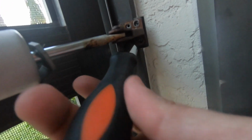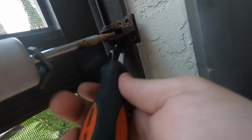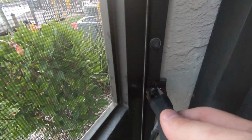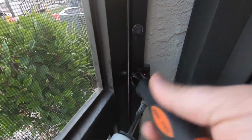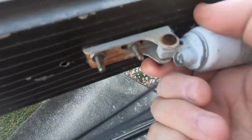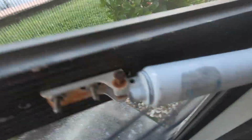This is a little overkill with 3 on the top and 3 on the bottom. The new pack, I believe it only has 2 on the top and 2 on the bottom. Finish it by twisting by hand. And this whole piece should be pretty dangly at this point. You can go ahead and pop this pin out. It comes straight up and straight down. Sometimes you might need some kind of hard object to hit up on it. And that comes right off.